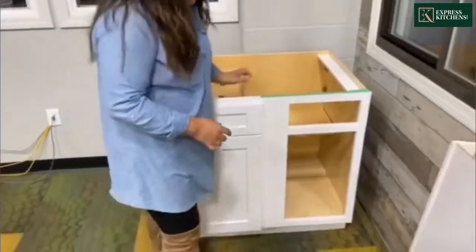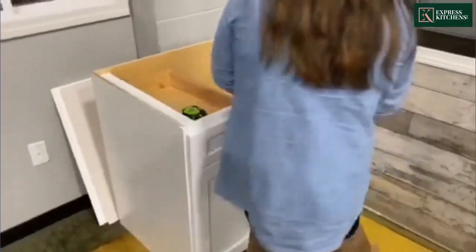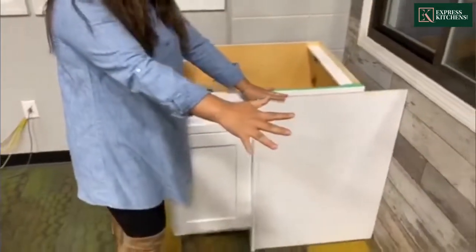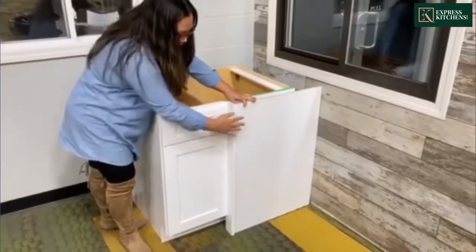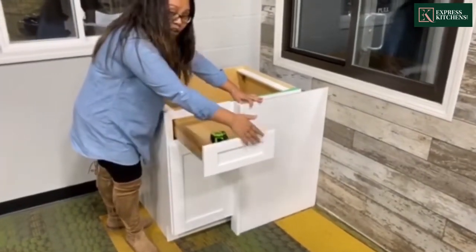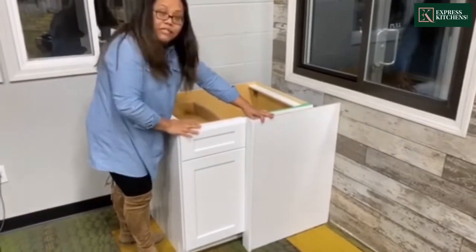What that does is when I put another cabinet or maybe a dishwasher panel to it here, say for example, I'm gonna put a stove in this area. If you notice, right now it's set at 39 inches. If I had a cabinet here and I tried to open this drawer, clearly it would hit the handle of whatever item is going here. So this is why we pull a blind cabinet to the next dimension, which in this case is 42 inches.